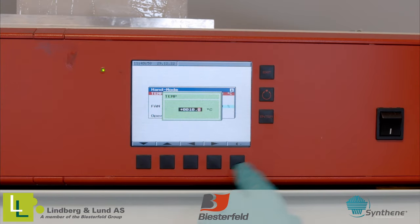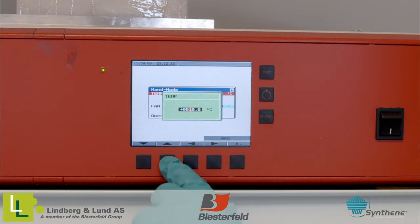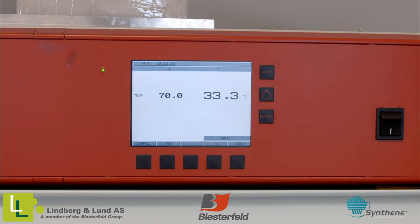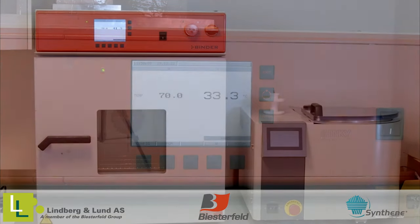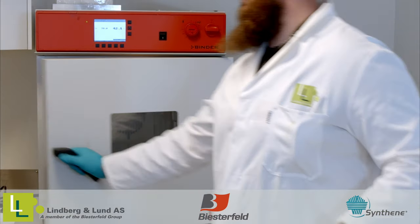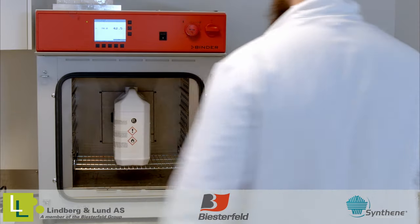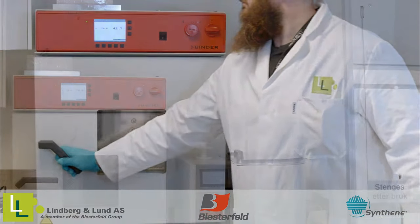To decrystallize HPE, the products have to be heated to 40 to 70 degrees. 500 grams need about 40 minutes in the oven, while a 5 kilo container would need a couple of hours. When the components are heated all the way through, it's time to take them out and give them a really good shake.